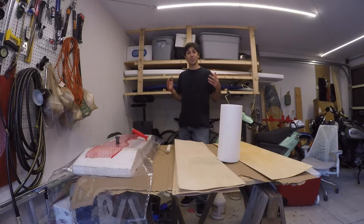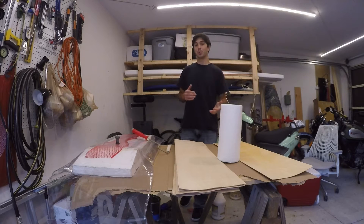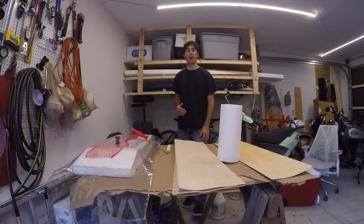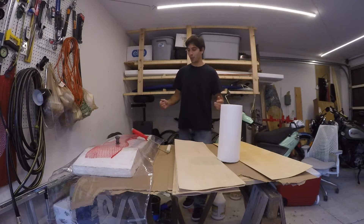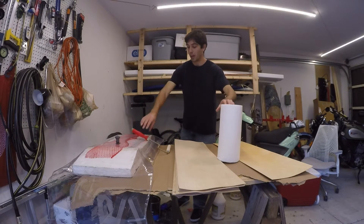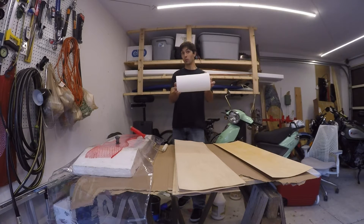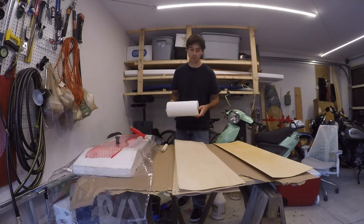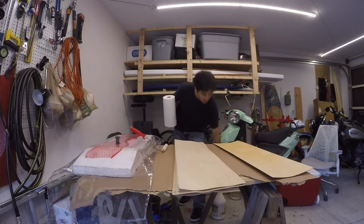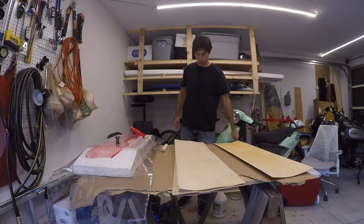This has to be really fast — as fast as I can go — and also careful, because it's really important to get just the right amount of glue on these veneers. So I've got my bag with the netting and the tape, my glue roller, my roll of paper towels — always good to have on hand in case you pour a little too much glue — my veneers, my glue, and my vacuum and pump are down here below.